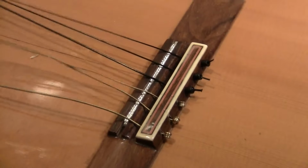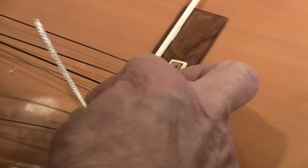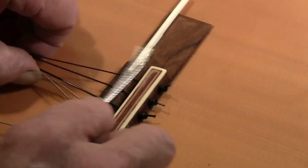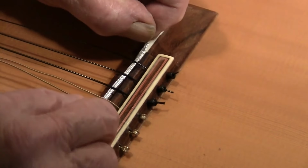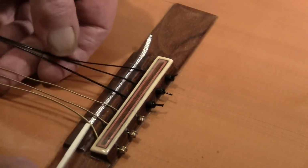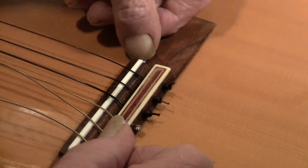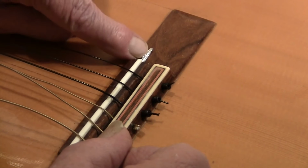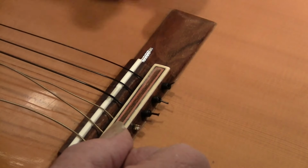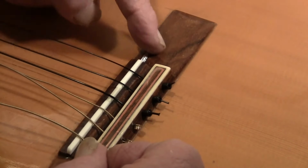Absolutely. Now, this may have been specially built. I can pull this up out of here, which I've already done. There. Can get a little more out of it. Put this back in and see if we've been able to move the area of sensitivity. Of course, we'll be left with this little thing sticking out here. If we cut it off, it'll break the connection between the outer jacket, which is ground, and the conductor. It has to be complete. It is right now. That's why I left it sticking out.